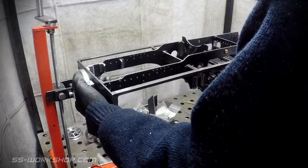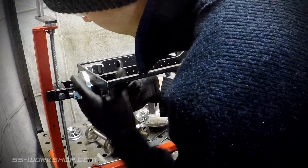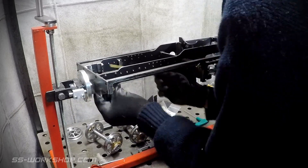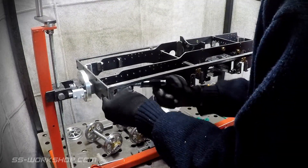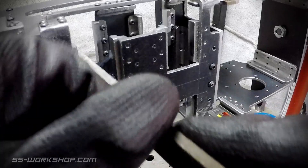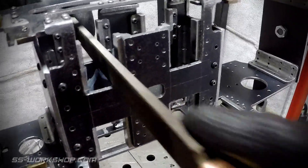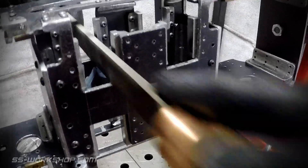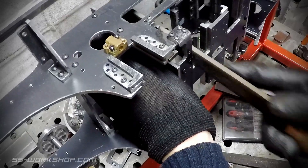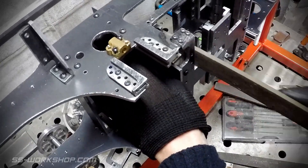Locating the frame back on the stand is a relatively simple procedure, with just a couple of screws in one end to hold it in place. The filing is undertaken carefully, with the safe edge riding on the frame. The material is removed slowly until the protrusion is flush with the face of the horn block.